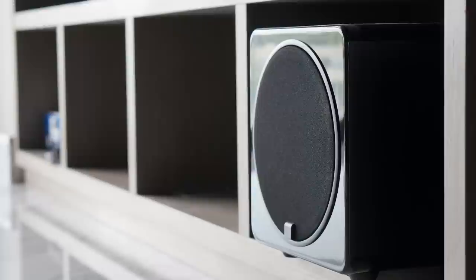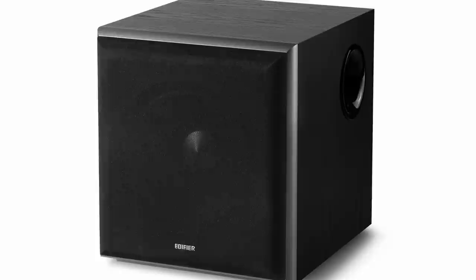If you haven't tried a subwoofer, you can pick up a subwoofer for, you know, under a couple $100, $150. They really, really help the amplifier perform better in that you're taking the low frequencies, which the amplifier needs a lot of power to push, and you're delegating them to a subwoofer, which leaves your amplifier to handle the higher frequencies and the mid frequencies, which they can do a lot better, being some of these are only 15, 20 watts per channel. And you're really getting some good low end you might have been missing all this time. So in my opinion, for under a couple $100, adding a subwoofer to your vintage stereo, I would highly recommend it. I really don't see a lot of people being disappointed with what they hear. So anyway, that's our number 4 spot, and that is adding a subwoofer to your vintage stereo.